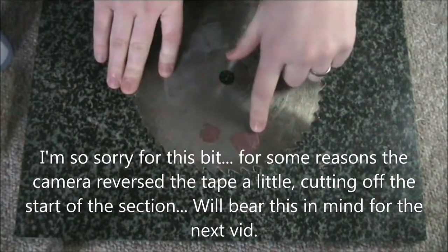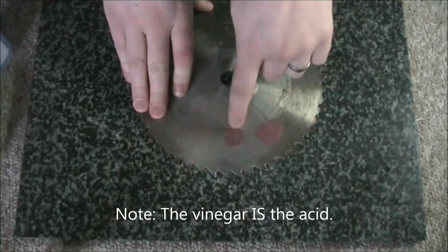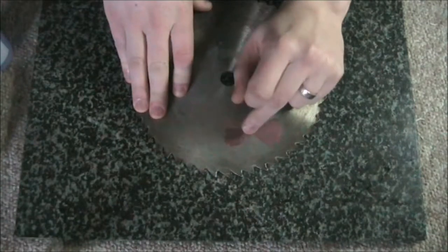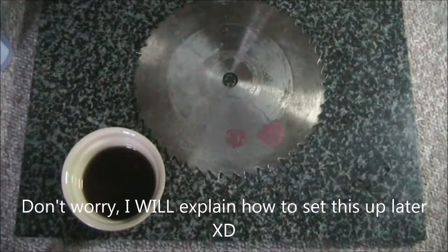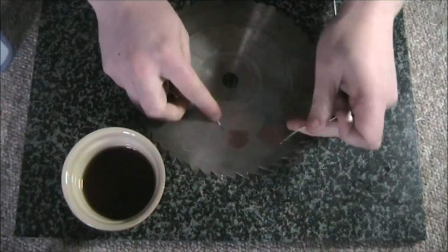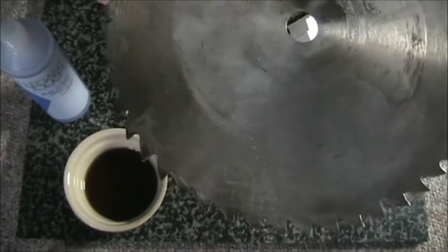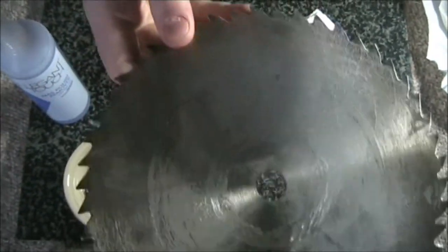We've got one basic test without electrolysis and another test using the acid and electrolysis. The reason is I want to see if any acid gets underneath — in case there's an air bubble or where it hasn't attached properly to the steel. So here's the vinegar, put it on there, and we've got the battery with the wires — just hold the wires to the metal. I didn't do it for particularly long, but you can probably just make out that it has etched it just a little bit. It says 'test' and it hasn't tarnished it at all, so I'm going to carry on with that nail varnish.